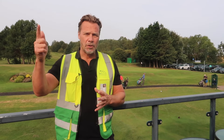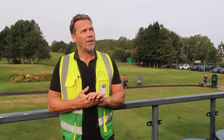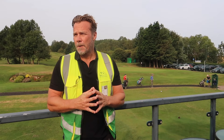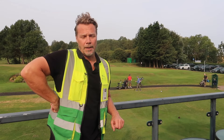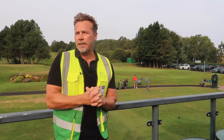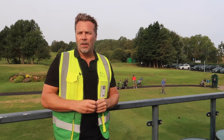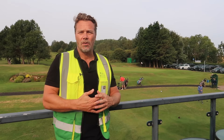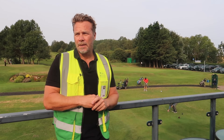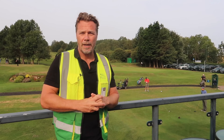We're obviously going to get these panels finished now. Brad's already grinding away out there behind me. We've just got the DC cables straight out - that was the first thing we did - for the 16 panels going on the large south roof. I went and got the wood on Saturday for the little wall we're going to build. I'm going to make a start on that while they're doing the panels, then we can look at getting the inverter and all the isolators mounted. Hopefully we could get all the cables clipped back and maybe even make a start on the AC cable.